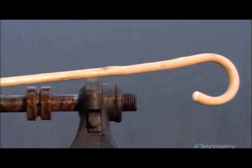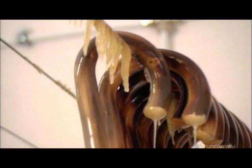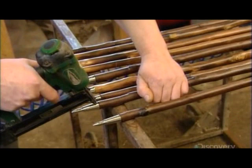A dip in water-based lacquer gives this walking stick a high gloss. They hang it to drip dry for an hour, after which the walking stick is ready for the end cap, or ferrule. Ferrules come in a variety of styles — there are blunt ones for a good grip on indoor surfaces, and there are pointed ferrules for navigating rougher outdoor terrain. After hammering the ferrule onto the stick, he drives a nail through it to secure it.